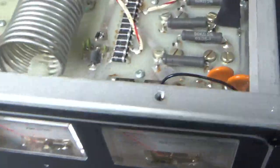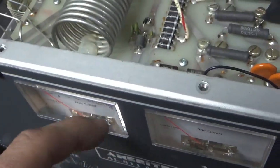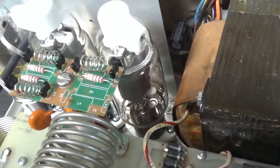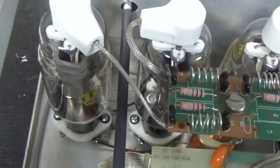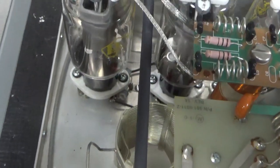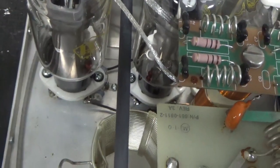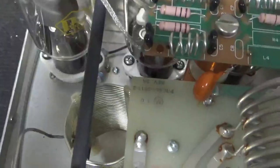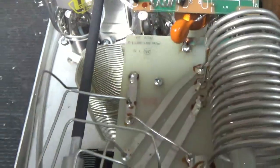Replaced the meter lamps — put in new LEDs with the proper drop-in resistor. There are two resistors in series with the LEDs within the meter movements, and one connected to the board. Cleaned the TR relay contacts, the input rotary switch, and the output rotary switch with Deoxit Gold. It's just a real pain changing that socket — the shaft came out, the rear shield came out — have to be really careful.